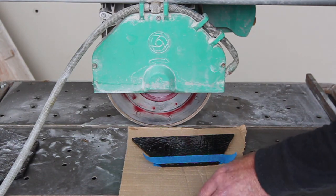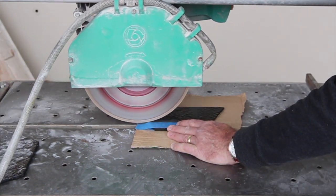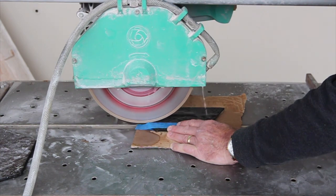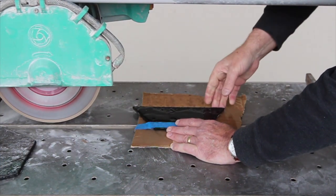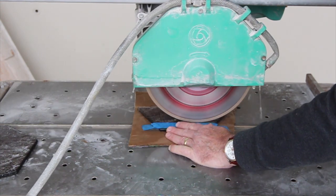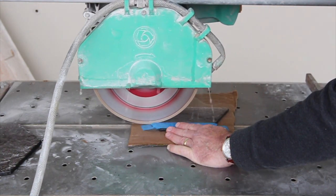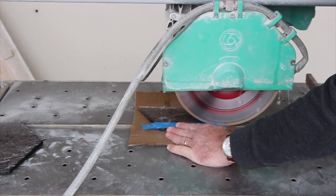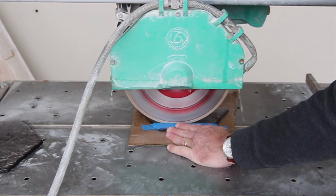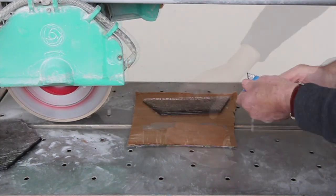Very small cuts are nearly impossible to break off with a tile cutter. Fortunately, they can be done on a saw without the problems we have on larger cuts. I'm using a piece of cardboard from the carton to protect both sides of the tile. With all glass tiles, cutting all the way through creates chipping that can't be fixed. On tiles like intaglio, where the color is applied on the bottom, these cuts will look especially bad in a finished installation. The solution is to cut about one-third of the way down through the color on the back side, then turn the tile over and cut about one-third of the way down from the top. This will leave a nice edge on both sides. For the best edge, you'll also want to use a fine stone or disc sander to smooth out the top side on all cuts, including those made with a glass cutter. I hope this gives you a good understanding of how to successfully cut intaglio glass. These techniques will also work with almost any other kind of glass tiles you might run into. Thanks for watching.